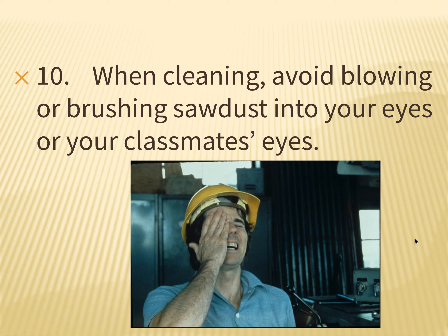Number ten: don't ever blow sawdust. When you're cleaning up, don't blow the sawdust to clear it out. You want to always swipe the sawdust with your hand onto the floor or into a dustpan — preferably into a dustpan to help with cleanup. If you blow it in the air, we all breathe it and it gets in our lungs. Or it gets in your eyes, and that can be a big deal even with your safety glasses on because sawdust is so fine it can float in the air and get behind your glasses. Always swipe it off with your hand.